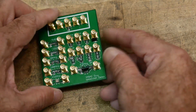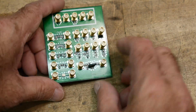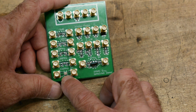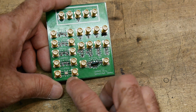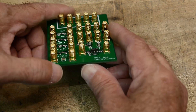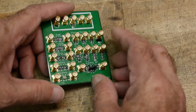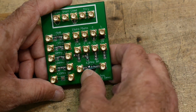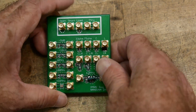The other problem is there was a PCB layout error on this filter here. I was able to remove the 433 bandpass filter using a hot air station and reflow it onto this pad, so that worked fine. But for some reason this one's dead — it's not working right. I originally tried to remove it with a hot air station and may have damaged this part. So in addition to the layout error, I think I damaged this part. That's not working right now, but everything else works.